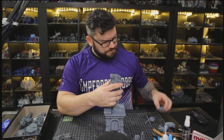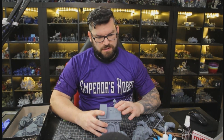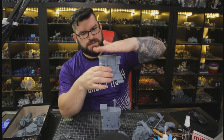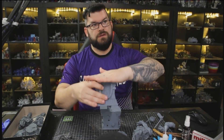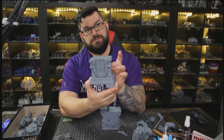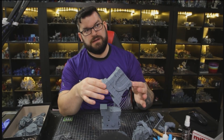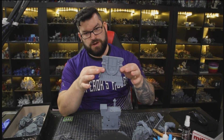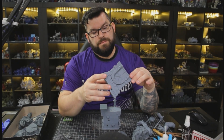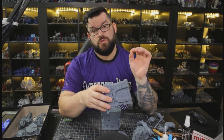The thing about this particular print is the bigger the prints are, the thicker you need the supports. When you're printing, you're essentially printing it upside down - the plate is like this and it's slowly printing from top to bottom. You don't want your prints completely flat because you create suction and it'll rip off the print plate. I always like to put mine at a little bit of an angle, usually between 20 and 30 degrees from straight up.